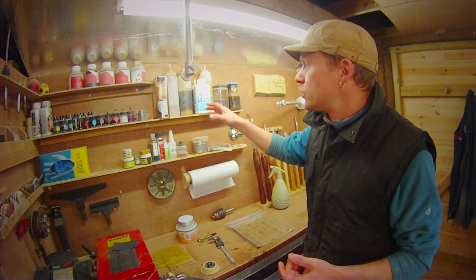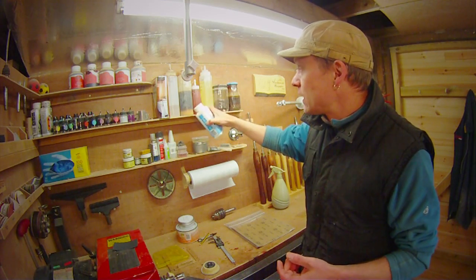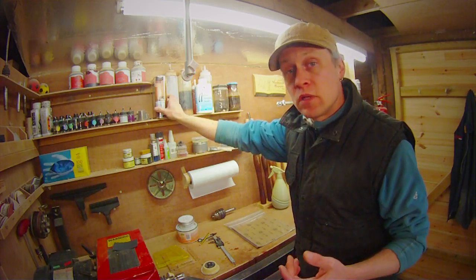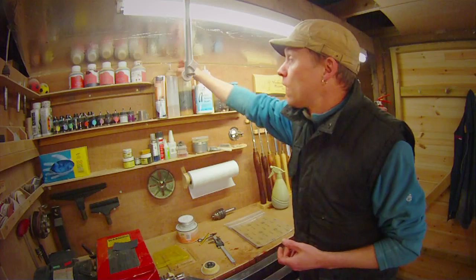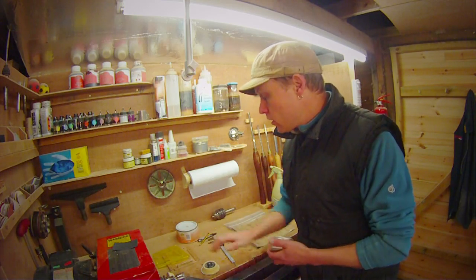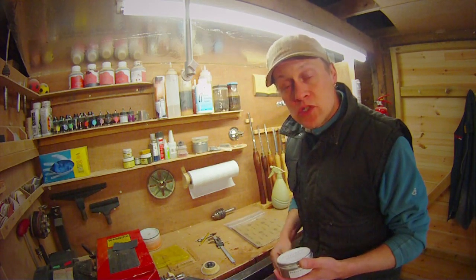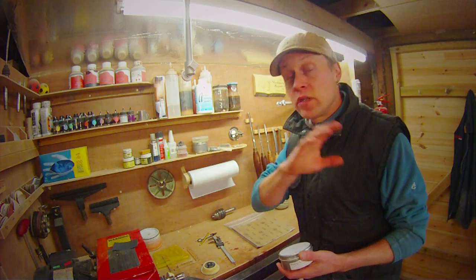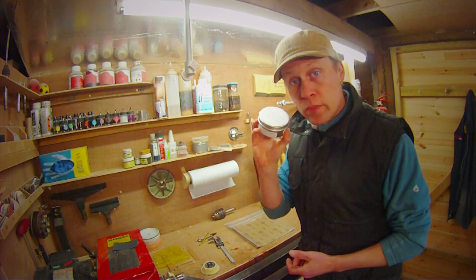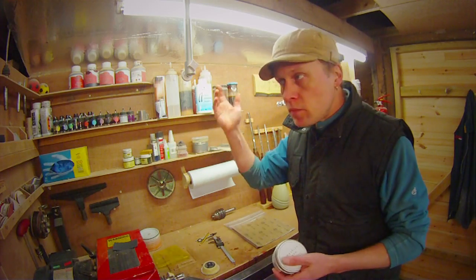For finishes I use a variety of finishes and sealers — cellulose sealers, acrylic sealers, shellac sealer, and finishing oils. I prefer Danish oil but there are loads of other finishing oils. I also use a food safe oil and over the top of that you can put waxes — Wood Wax 22 and loads of others. But what you'll see me using in the majority of projects in this series is my own finishing wax which I call Hampshire Sheen, and perhaps a Wood Wax 22, Carnauba wax, or beeswax.